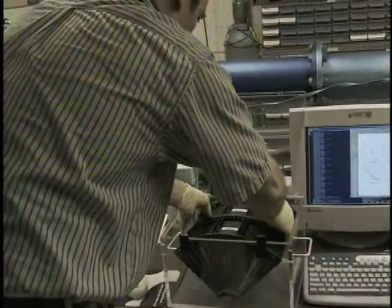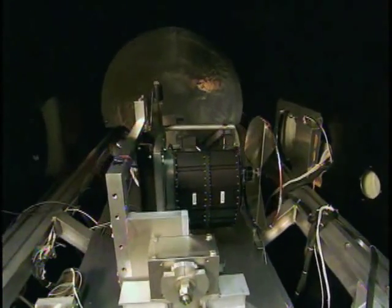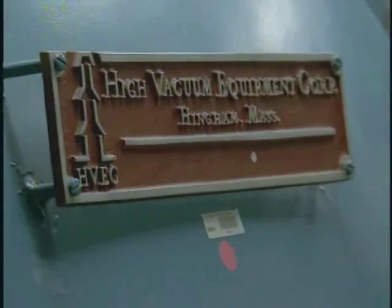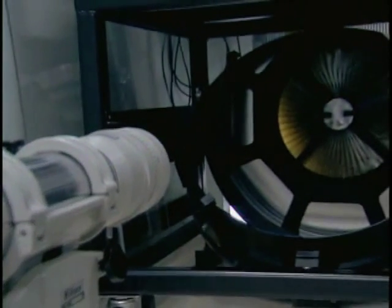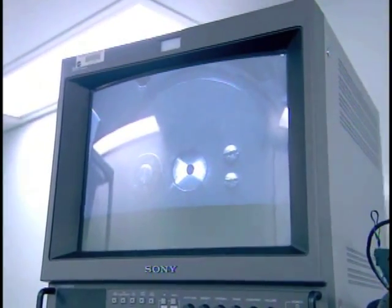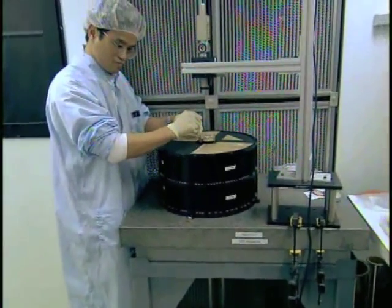So then you've got a quadrant. Now we're going to do some optical testing with that, and then we start doing X-ray testing. What we're looking for is to contain the photons in as small a circle as possible — the better the focus, the more photons will arrive onto the XRS. The process is done in optical and white light by putting the four quadrants on the ring and adjusting until they all project to the same spot. With the assemblies complete, the telescopes can be packed and sent to Japan for further testing and final assembly onto the spacecraft.